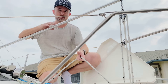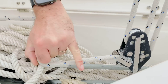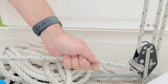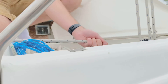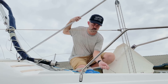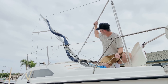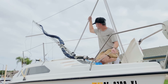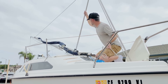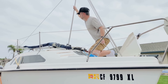You're probably wondering how to lower the mast. First thing you need to do is unhook this line right here — be careful holding it because if you let it go, the mast comes down. Very gently, grab about a foot or so of line while holding onto the gin pole or assisting pole. Take out just a foot or so at a time, using that same motion, and it'll come down nice and smooth. Try to line it up and steer it a little bit using the pole, because you need to aim for that roller. Let it down nice and easy.